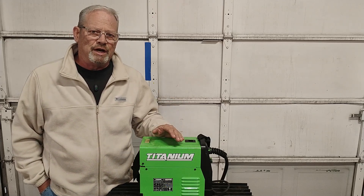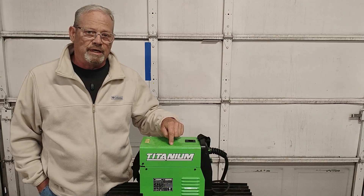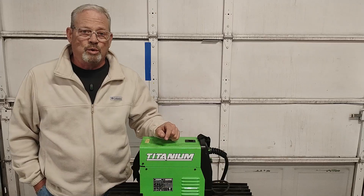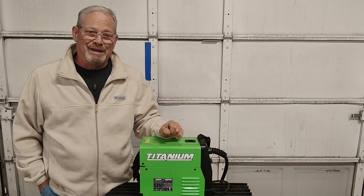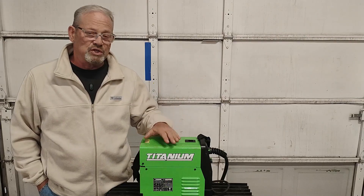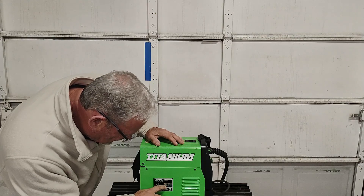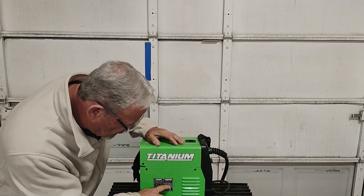But don't let 30% scare you. The Titanium Easy Flux 125 is rated at 30%. My Yes Welder Firstus DP200 is rated at 30%. My Prime Weld MTS200 is rated at 30%. My Engine Drive Vulcan Outlaw 195 is rated at — you guessed it — 30%. Now, that 30% is when the machine is running at its maximum. On this plate it has 30% at 90 amps, 60% at 64 amps, 100% at 50 amps.